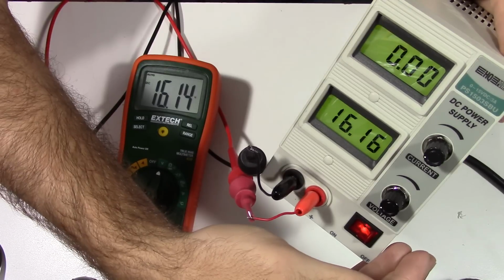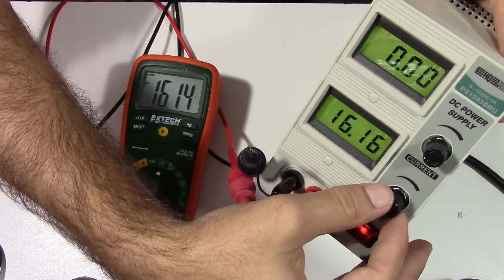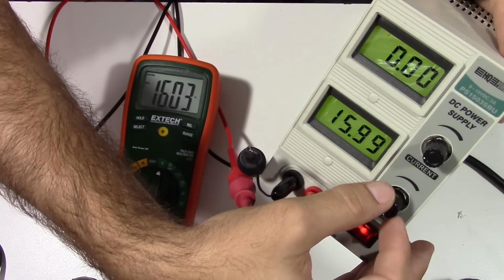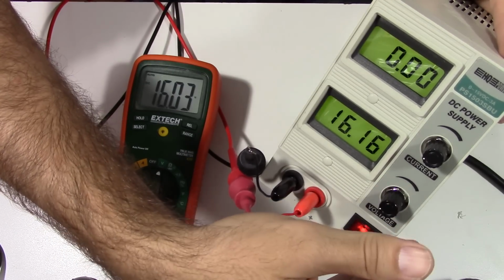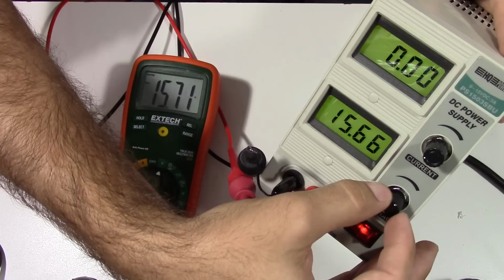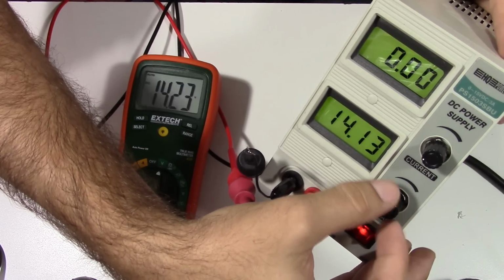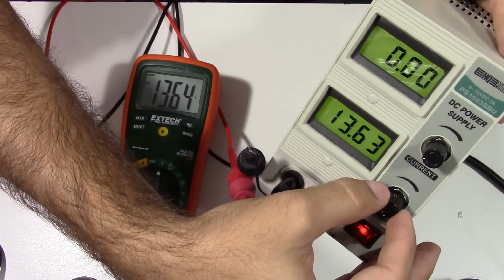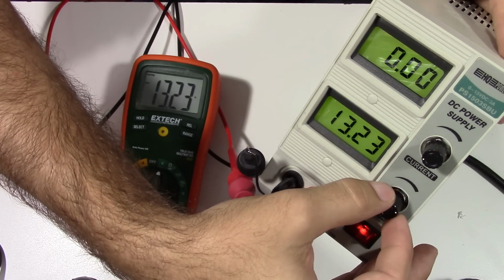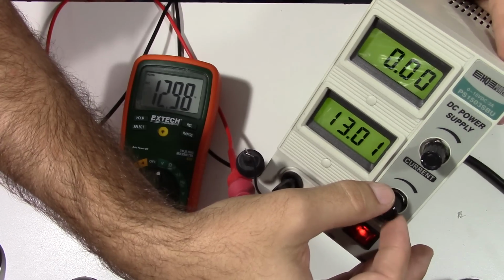Now that range is down to 16 volts instead of the 22 or 23 volts we were getting at the upper range. So definitely putting in that 22K resistor across there helped, brought it back down more in spec. And yeah, anyway, I think we have accomplished our goal. Now this is just the voltage, so I will try out the current also.